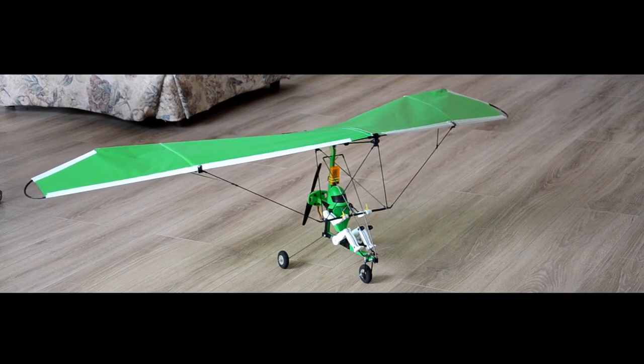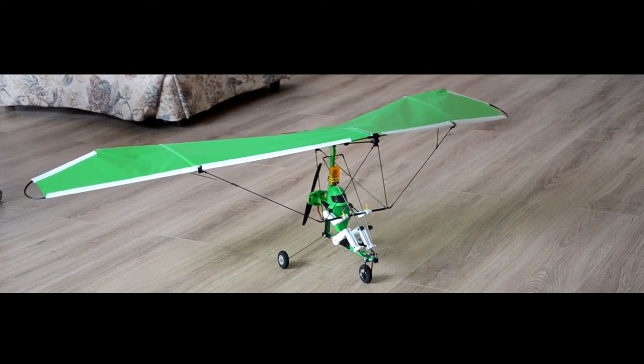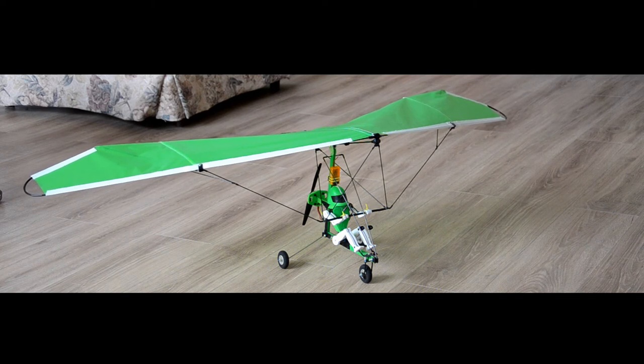The landing gear at the front is a dual fork landing gear. Now, that's something I was about to change and make into a simple single fork, single axle steerable landing gear, but I could not get it as good as you see it in the videos, the original one. The original one, as you see it in this video, has quite a number of parts, but it is necessary in order for it to have the suspension and also have the stability in directional control. The two forks are a lot better than a single fork, single axis steerable landing gear, in my opinion. And so I kept that there, even though it's a little more complex and a little more assembly time for the user, but you have a much better front end with this particular model.